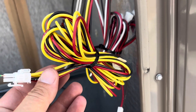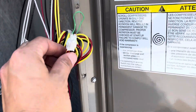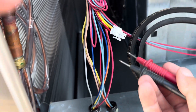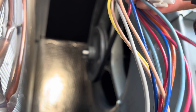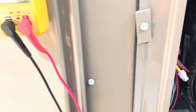Everything's so new here. I do have wiring here which I can repurpose — this would have been used if the unit was originally installed with a duct smoke. This wire just comes over here and that's it, not connected anywhere else. I wanted to confirm that by ohming it out, so I looped my two yellows together, which are going to be my sensor wires, and confirmed continuity. The numbering on the wires matches up, and I'm going to do the same thing with the black and red just to make sure.